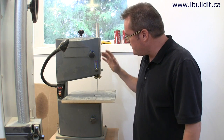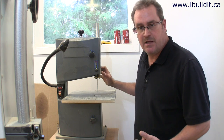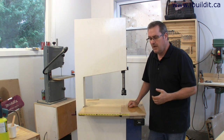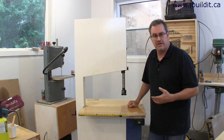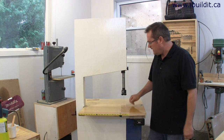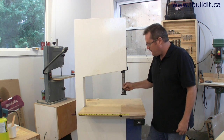For more detailed work I modified this one right here. It's a store-bought bandsaw but I added a one horsepower motor to it and internal dust collection. But the problem with that one is it's a relatively short blade. A longer blade obviously has more teeth and will definitely last longer, stay sharper longer, and make better cuts.